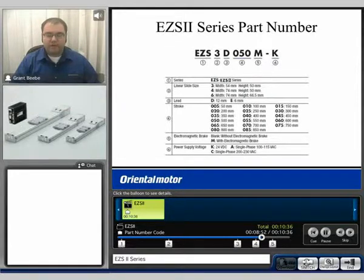We have both a 12mm pitch and a 6mm pitch option. We have an effective stroke range, depending on the frame size, of up to 850mm. Stroke ranges are available in increments of 50, starting from 50mm all the way up to 850. We do have magnetic brake options available for all packages, which are utilized to hold the load in place once power is removed from the system.